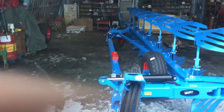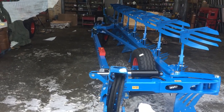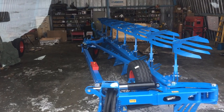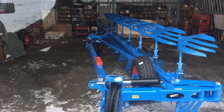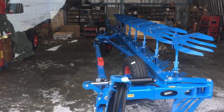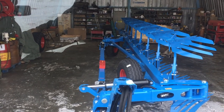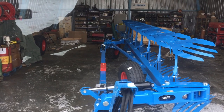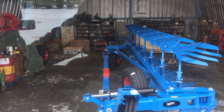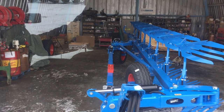Which obviously if I do it this way it might be easier. So right now I'm actually pushing the plow outward away from the tractor, giving me more clearance. Now I'm going to suck it back in — this will be more for road transport. So this plow's got some really cool features, and you can raise and lower it with SCV number three, and then obviously your three-point arm because it is a three-point attachment. I'm going to roll it back over to the left.